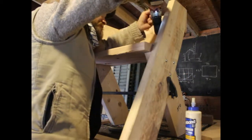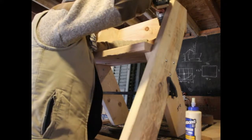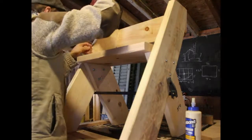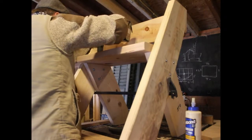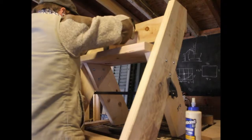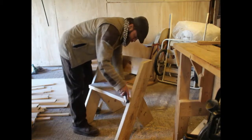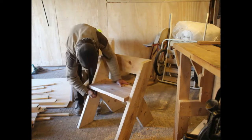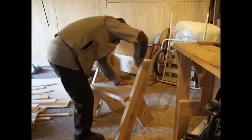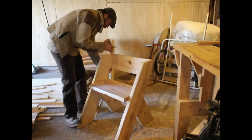In go the three screws, spaced nice and evenly. Don't get too close to the front, because if you get too close to the front angle you might pop the screw out of the angle — give it a couple of inches from the front angle of that support leg. Now I release the clamp and I have my chair. It's supposed to be rustic, so I'm not spending a lot of time smoothing it, but I do want to take off the rough edges from sawing and chamfer the edges, which means giving them a 45-degree angle just on the edge — it just makes it feel a little nicer and won't catch anyone's clothing or fingers.